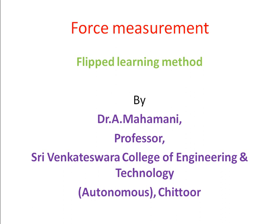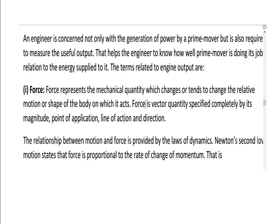Here we can measure the force in cutting operation. We have lathe tool dynamometers, and for drilling we have dynamometers to measure the torque and thrust acting on the workpiece material. If you allow excess force, we will face problems in terms of residual stress formation. With this residual stress, when going for application, failure is initiated. That is why we measure the force. Once we measure the force, we can control it so that we can apply the required power to machine or form the component. So this is the reason why we are studying force measurement.